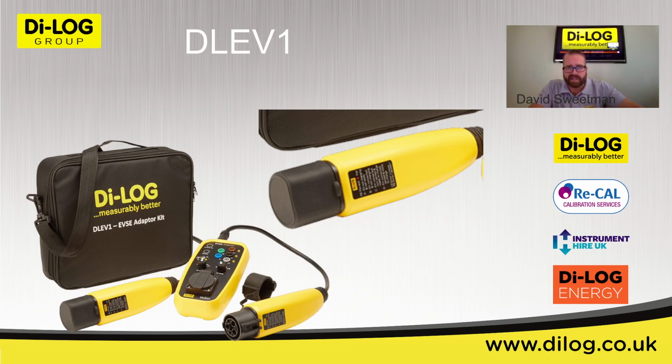But control pilot is the main communication that you will use between the EV adapter and the EV charger as well. So each particular setting, you can't see it from this diagram here, but what I can do is show you from this angle here. There's an EV adapter there as well. So you've got control pilot states A, B, C, which relate to non-vented charging, and then you've got a D, which is for vented charging itself.